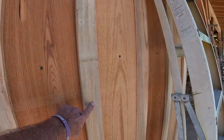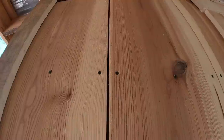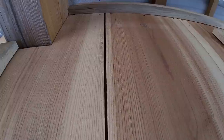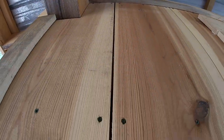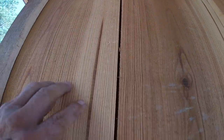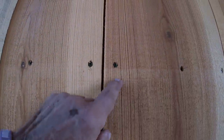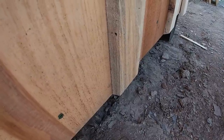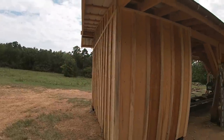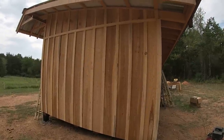The batten strips I'm using are 2 and 3/4 inches wide — I kind of like that width, it seems to work well and looks nice. When I'm getting ready to put these on, I plumb down from a mark at the top, measure over from the center of the gap between the boards an inch and 3/8, and just use a long level to make my marks down through there. It's kind of hard to see them with the grain, but I know where to look. I also did a 30-degree bevel at the very bottom — just a little detail I like to do. So I've pretty much got the outside done with all the batten strips on.